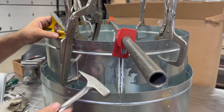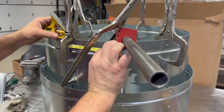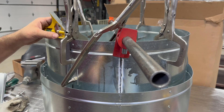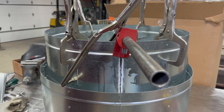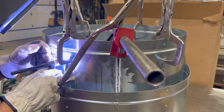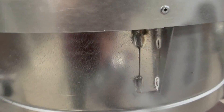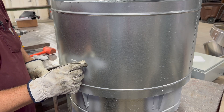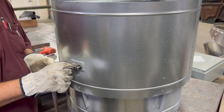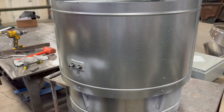I'm using those screw holes since they're spaced the same distance — I can center up the standoffs right on those holes and square the standoffs to the body. This is important because if those standoffs are off to the left or right, it could make it hard for the installers to get it on the pipe or could bind the damper blades. Those little things, attention to detail, give you a better product. Little things done right add up to a good project; little things done wrong can add up to it not working.